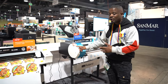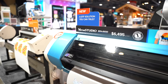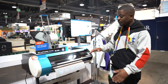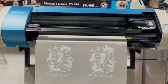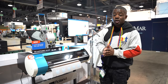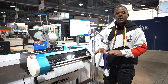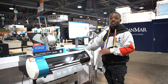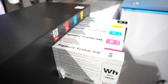What you guys wanted to see — and this one is already sold, so you know it's cool — it's the Roland BN-20D. This is a DTF version of the printer. Unfortunately right now you cannot hook it up to a powder shaker, because the way it prints is: it prints the color, resets itself back to origin, and then prints the white on top. It's not something you'll be doing at high volume, but it's an efficient way to handle low-volume full-color shirts. The BN-20D literally has the same parts — everything is there, including the white ink cartridge.